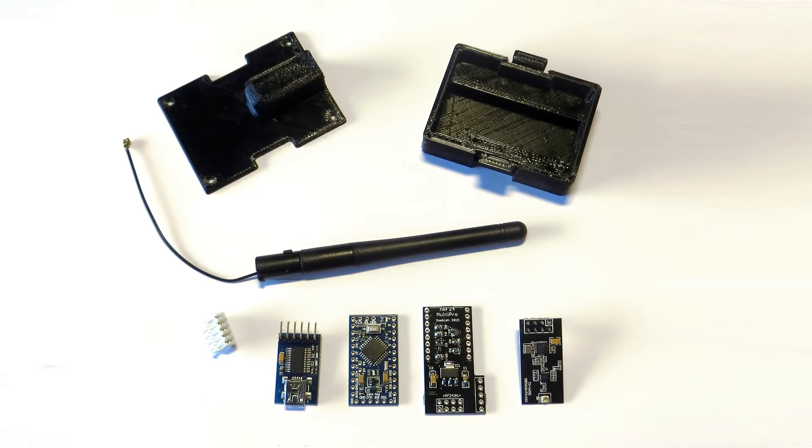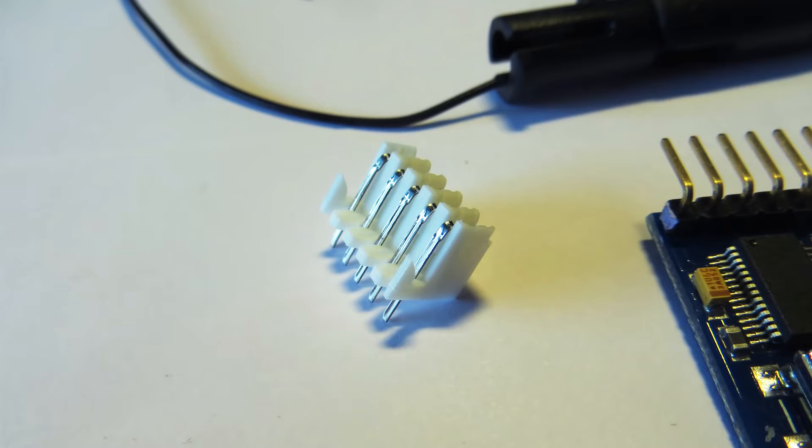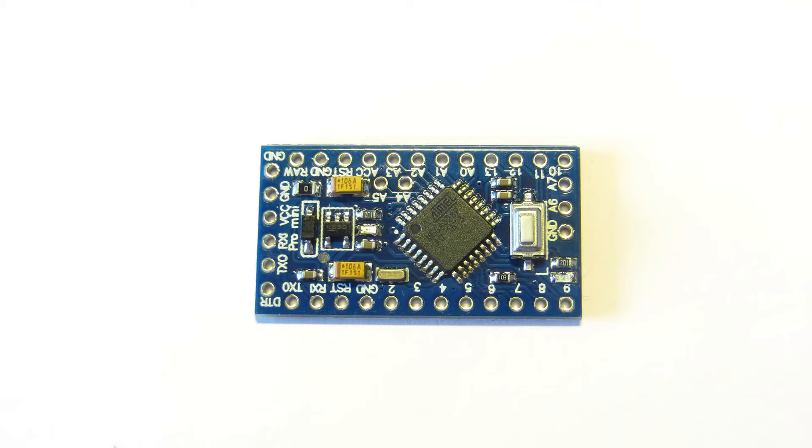You can contact Goebisch directly and ask him for the interface board, or if you don't want the hassle of soldering and flashing the code yourself, you can ask him for a fully built module — if he has one in stock, he may sell it to you. Here are the basic components you need for this mod: first, a connector that hooks up to the module port behind the Taranis, providing the voltages and PPM signal the module needs. Next, an Arduino board — a normal 16 MHz 5V variant you can get from Banggood for about $1.50.